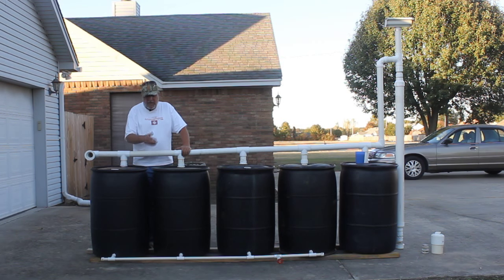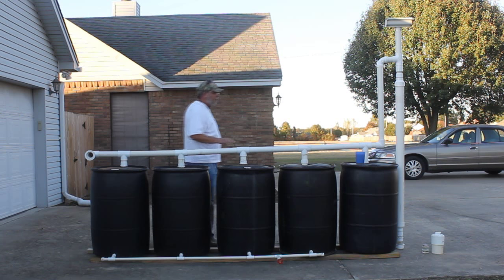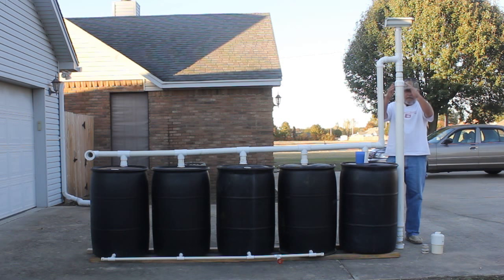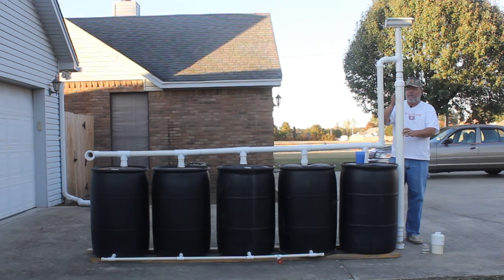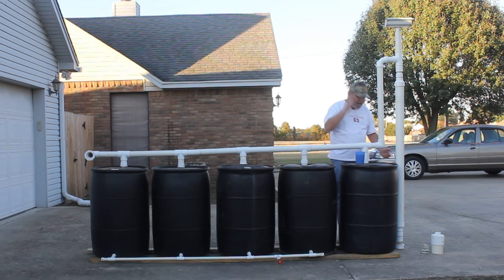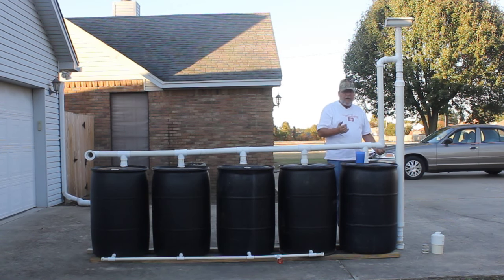The manifold system on the front most of the time has to be replaced each year, but I can cut a few corners on that. The way this works is inside this larger piece, which is 3-inch — it tapers out and then tapers back down. When the water first starts coming off the roof, you're going to have a lot of debris like bird poop, dirt, and dust. That dirt and dust goes into this tube first. There is a tiny hole — not even an eighth-inch — drilled in the very bottom so water will drain out, and I do have a way to remove the cap to clean it because it catches a lot of debris.